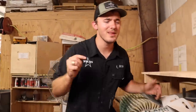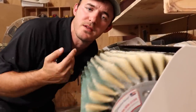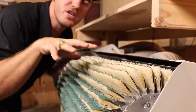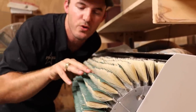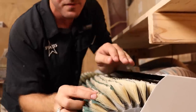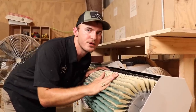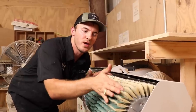So how does this machine work? It's relatively simple. You have these bristles and a piece of sandpaper, and this thing spins really fast. The sandpaper hits your material, and these bristles behind it give the sandpaper some stability, so whenever that material hits it has a little bit of bounce back to it. What's really cool is that I can customize all of this — different sandpaper, different grits, the bristles behind it. I can do three different grit patterns on this whole roll, and on mine specifically I have two different patterns cut in: a wide pattern and a thin pattern.